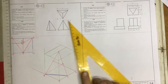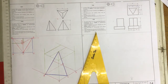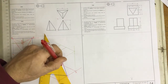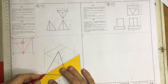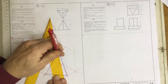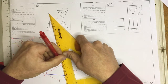At this stage, you are actually finished the drawing — you just need to darken that in. Most of you are looking at that and going, well, it doesn't make any sense — it's just like a flat triangle thing. But if I come along here and put some hidden detail in, you'll go, oh, there it is. There's hidden detail going across there. Can you see I've got a line going from D to C? There's D at the back going to C. And I've got a line going across from B to D as hidden detail, and a line going from D up to the apex as hidden detail. And now suddenly it's beginning to take some sort of shape that you would recognize as being the drawing from the orthographic projection.